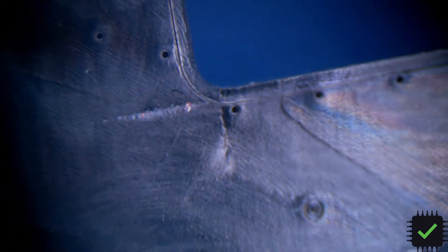I don't think this is the problem here. I don't think we have any issues with that crack because it doesn't look like it cracked anything major. This is just the ground, which makes sense because it's all the way on the edge — it's not really possible for any major signal lines to run there. So I don't think this crack area is the problem at all.